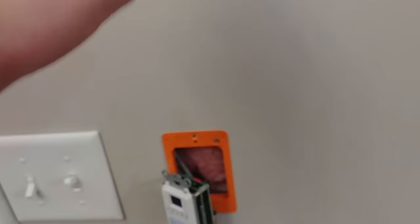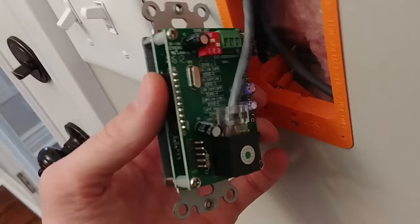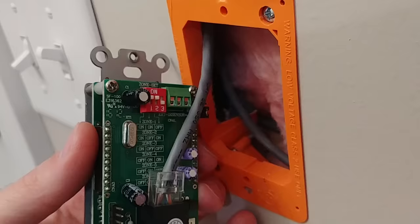So that's where these are a little bit different. On the other side of this wall is my outside box, so I ran both wires down this wall — one goes outside for that keypad and one stays inside. The way you change which zone a keypad is going to control is those dip switches on the red piece at the top. Each one corresponds to a certain zone, so every keypad is going to be slightly different.